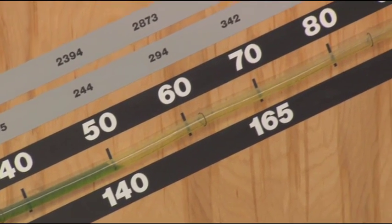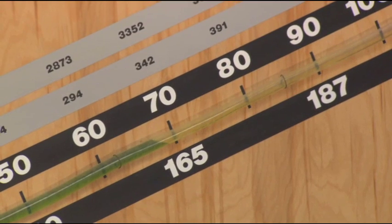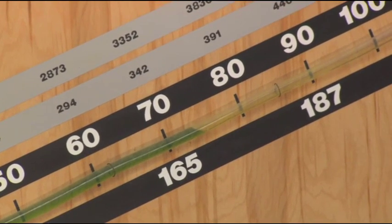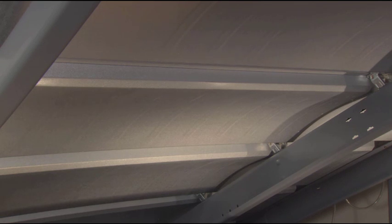The next level of performance is a UL class 60, which is 75 pounds per square foot of uplift pressure. During this phase, we'll also run a cyclic phase. Since wind is not a nice static load, you have to cycle it back and forth to simulate gusting. At this point, we actually simulate that by changing the pressure.